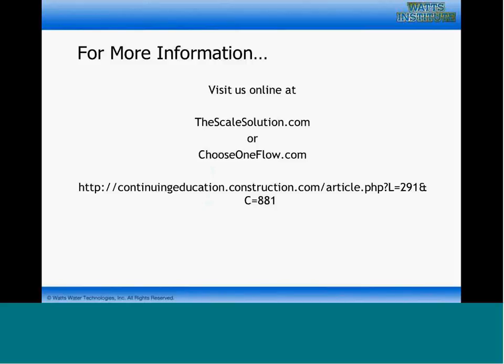The brine tank is in a water softening process, which is also referred to as ion exchange. The brine tank is actually storing salt. It could be rock salt, but typically you want to put in pellets of salt there. The salt then gets mixed with water, which is added from the control valve. When water and salt are together, it creates a brine solution, a salty solution. That salty solution is used to regenerate the water softener resin because, again, we call a softener an ion exchange system. With ion exchange, we're removing calcium and magnesium that's in the water and replacing it. The exchange ion is actually sodium. So the sodium chloride, which is created by that brine solution, is used to regenerate the resin and prolong the life of the water softener.